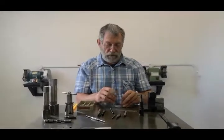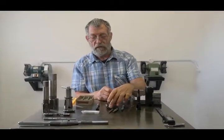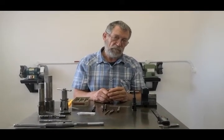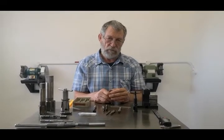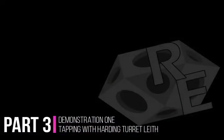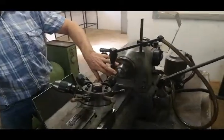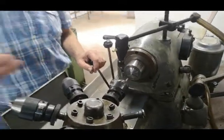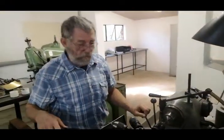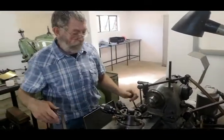From here I'm going to do a couple of demonstrations. One on my little turret lathe where we're going to tap on automatic — it's my second operation machine used for most of our barrels for pivot screws. We're here at the turret lathe running little 5C collets — these are the folder pivot barrels we use for all of our pivot screw heads. I'm going to do a quick automatic tapping operation. Using a spiral point, you will see no shavings coming out — the shavings are getting pushed inside the spindle and out the back.